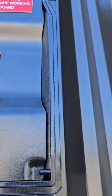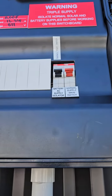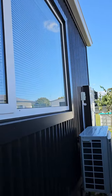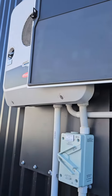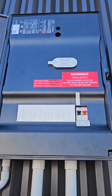If you kill that supply there, it will kick into battery mode. So if you want to kill total supply, you can kill this supply here, kill the battery on that AC isolator, or kill the inverter on the DC switch. You can also turn the main switch inside the house — that's if somebody wanted to work on any of the electrical equipment.